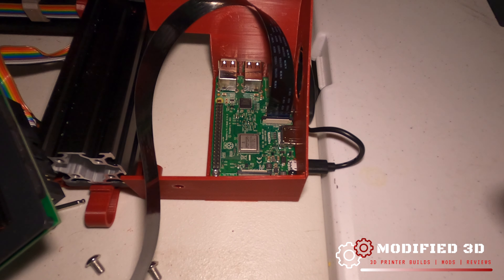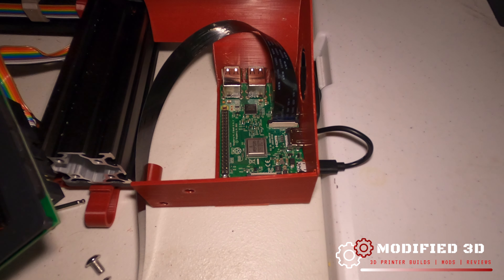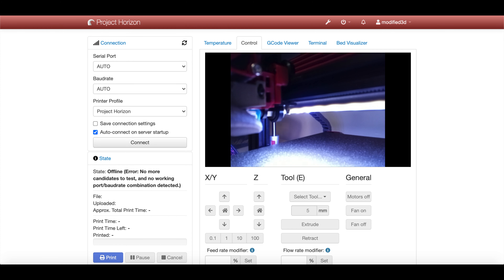We're going to go ahead and power on the Pi just to test everything before we put it back together. Let's go to our OctoPi.local address and pull up our OctoPrint instance to see if our webcam is working. As you can see, we've got a good picture. If you ever need to flip the picture — say it's oriented the wrong way — you can go into settings at the gear on the top right of your screen, and there's a webcam tab with options for flipping.